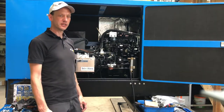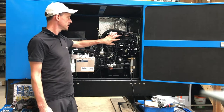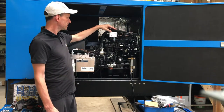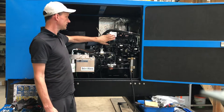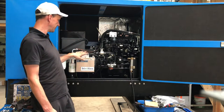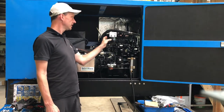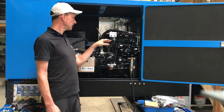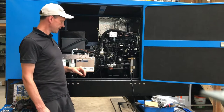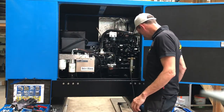So here we are, finally we have done all the tubes and installed the new filter. So the idea was to get the hot water from the engine down here to the filter. The filter is heated, then the hot water goes down to the manifold and the manifold is heated as well. And we have a small filter here to keep the volume as low as possible to make it easy for flushing the engine.